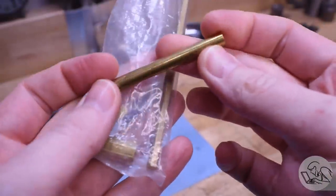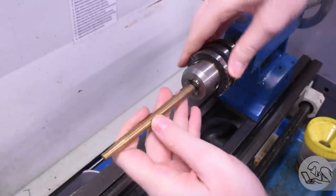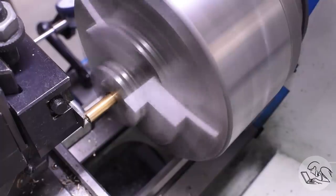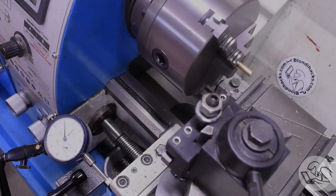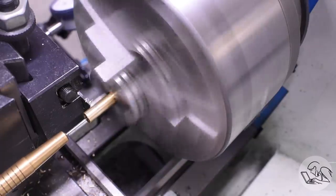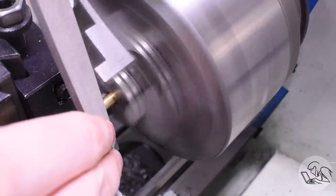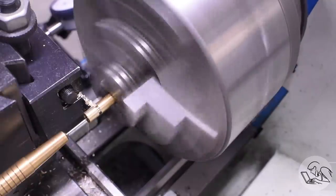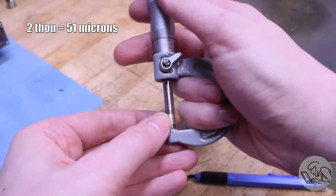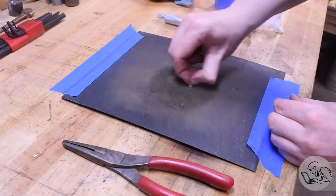The last parts of the assembly are some little risers. The kit came with a piece of brass for the purpose and I'm going to make them all at once. I'm drilling all the way through for all four. I'm going to make these parts entirely with the parting blade - facing off one end, then setting up my indicator and moving it over the exact length of the part plus the width of the parting blade. I start the part and pause halfway through, deburr the back side, then finish the cut, and move over the same amount for the next part. In principle all four should end up the exact same size. In practice I ended up a little oversized - about two or three thou each, probably due to deflection in the parting blade. That's actually good news because I can easily bring them down to perfect size on some emery paper.